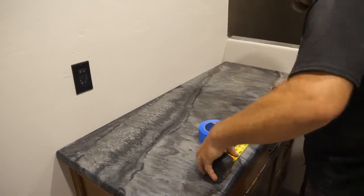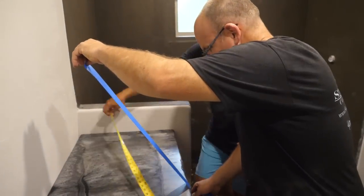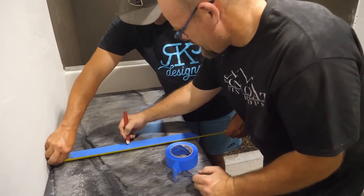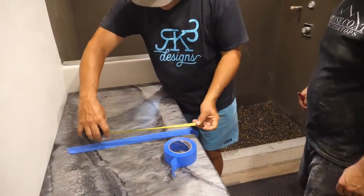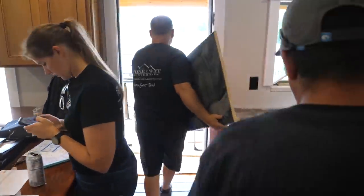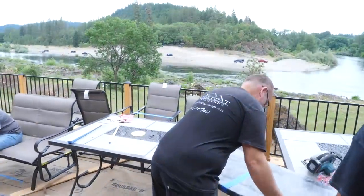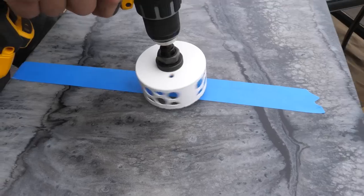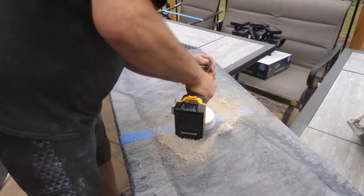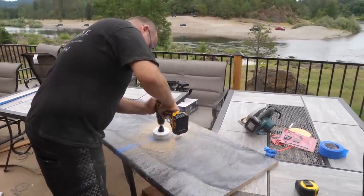I'm finding the center point by using the handle of the cabinetry as my reference, then putting blue painter's tape so I can draw on the surface. I'm going to use a large four-inch hole saw because I'm installing a flat-bottom vessel sink and need to attach a tail piece — I need a big hole for that. The vessel sink has a large footprint that's going to hide this hole, so give yourself plenty of room and don't fight the plumbing. That's a pro tip.